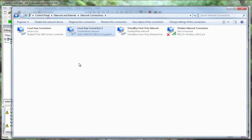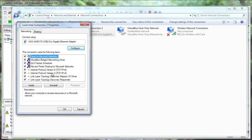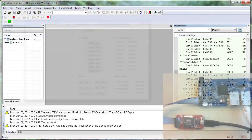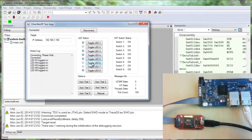To do this, I simply go to my network interfaces, right-click on the network interface I'm going to be using, and choose Properties. I go to IPv4, choose Properties, and I set an IP address that's compatible with the address on the board. In this case, I chose 192.168.1.101 with the subnet mask of 255.255.255.0. Once I have this done, I can start up the Renesas application that allows me to connect to the board. I type in the address of 192.168.1.100, choose connect, and you can see that it connects. I can then toggle LEDs on the board on and off — this is a very quick way to test the Ethernet capability of this particular application.